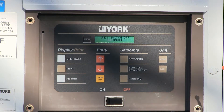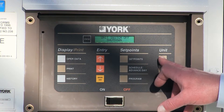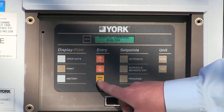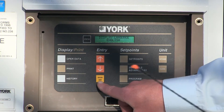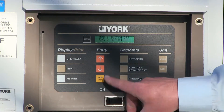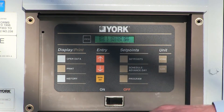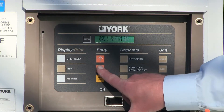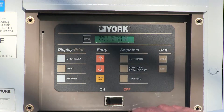The clock button is simply for setting the time and date in the chiller, which comes pre-programmed from CAPS. To get started, go into the Options button, push it one time. The Enter or Advance button allows you to either enter a value or advance to the next menu. The first thing that comes up is display language — English is fine, advance. The next one is probably the most important menu selection: system one switch off and system two switch off. Change that value using the arrows to turn system one on and two off, two on and one off, or turn both systems on.